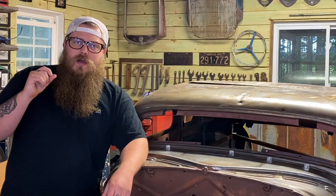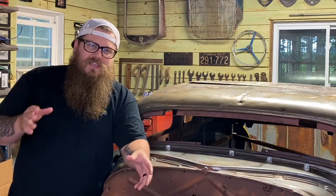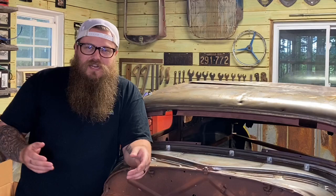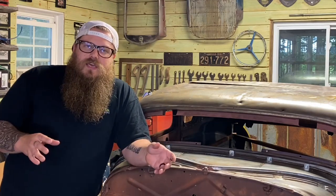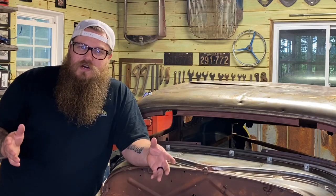Make sure you have really good grounds. I test all my grounds with a voltage meter. We have a ground coming in for the gauges — wiring up the gauges is a little more complicated and I'll make another video for that. But as an example, I'm going to ohm test the ground wire somewhere on the body or the steering column bolt to make sure it has a good ground. Everything that is a ground, always double check with a voltmeter and ohmmeter — make sure you have low resistance and that it actually exists. Not checking this stuff when you get to the final product, you're going to be wondering why something doesn't work, and it'll come down to you didn't scratch off enough paint on one ground strap or ground wire. Trust me, I've been there — find those issues up front, not at the very end.